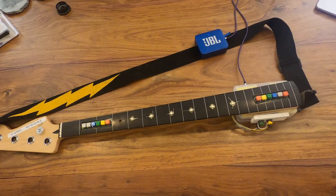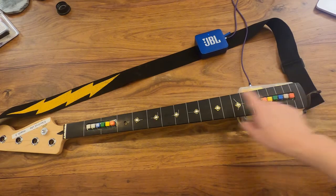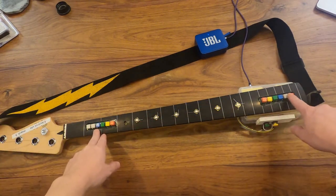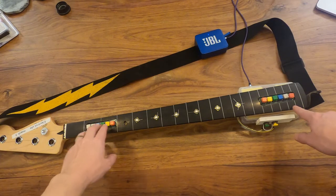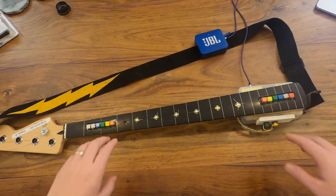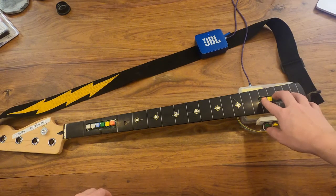And so the next instrument I wanted to show you is the ElectroLute Mach 3. You can see this is laid out pretty similar to the ElectroLute Mach 1. Six buttons on the right, six buttons on the left, and these buttons do the exact same thing. This is a pentatonic scale. These are four separate chord buttons that can be combined up to 11 different chords, depending on which buttons you're pressing, plus down an octave, up an octave. But the real magic comes in here. This is using a Teensy audio chip, so it is able to produce significantly different voices.